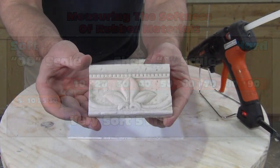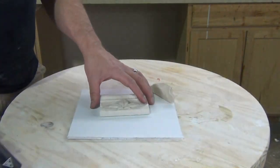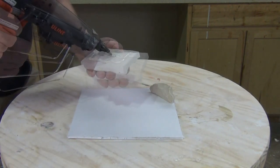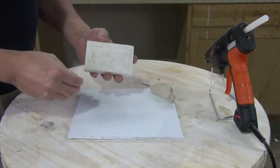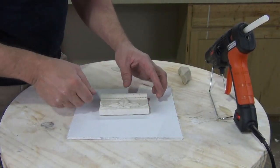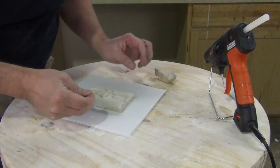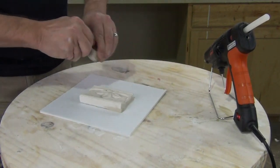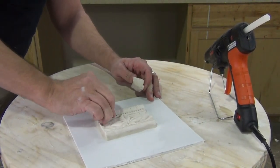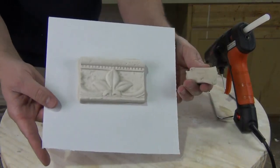For this mold on the rectangular tile we're going to make a simple foam core box, as we've done in previous videos. The key thing to bring up is that all the different elements of your pattern and your casting material go into choosing the mold material — and remember, there are a lot of exceptions. In this case, even though we could use a firmer silicone, the casting material dictates we use a softer material to help grab that metal powder.